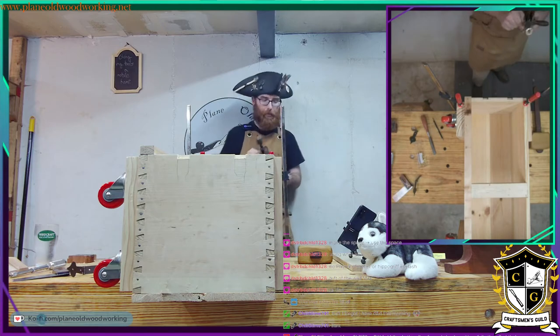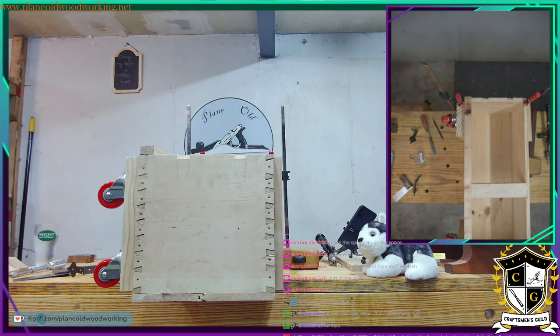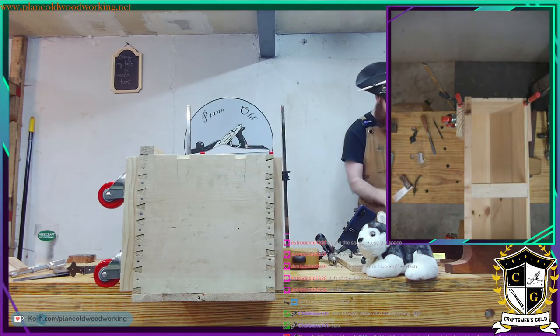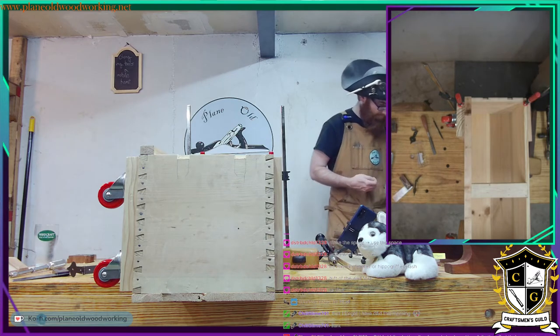That is, if you're using brass hardware, brass screws, whatever, get a normal screw first. Now, where are my old normal screws? Because I only have a few of them left. Oh, it's not that I have a few of them left. The ones that I have left are like 2 inches long. I only have a few of these short babies left. So brass is notorious for stripping out and breaking.